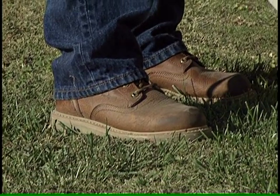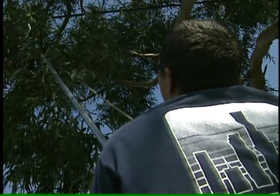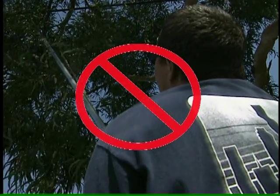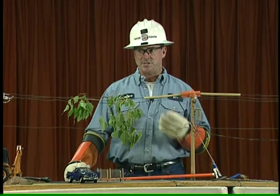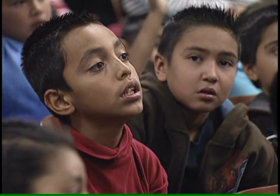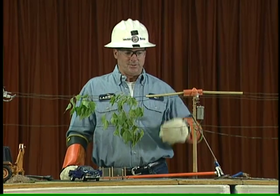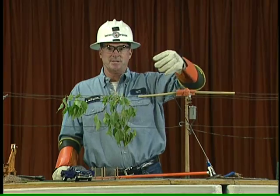It's a good idea to operate electrical gear wearing rubber-soled shoes instead of going barefoot. Still, rubber soles only help with low voltage under ideal conditions. Don't trim trees yourself if power lines run through them. What a lot of people don't realize is trees actually absorb moisture and minerals from the ground, so they're actually a conductor of electricity. Not only is the hazard the wire itself, but the leaves and tree branches can become a hazard too.